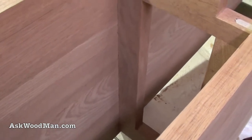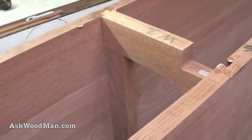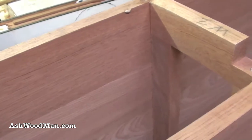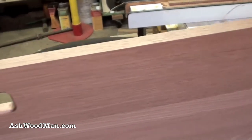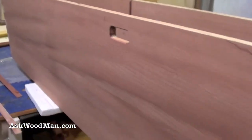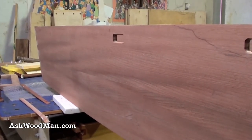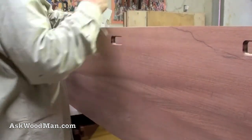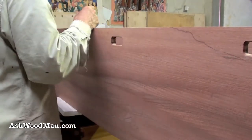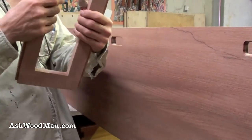Here's one frame already down in here — you can see how tight it was. There was no pressing it in by pushing or even hitting it with a hammer. I was hitting it with a hammer with a block of wood and I was afraid I was going to break my frames, so I had to resort to pressing it in with pipe clamps. The humidity has come back in and I think my panel has swelled up just a little bit. There's really nothing that can break on the sliding dovetail — I can't really crack my panel, and the frame really can't break unless I was whacking on it so hard that I might pop the dominoes out, but nothing bad happened.